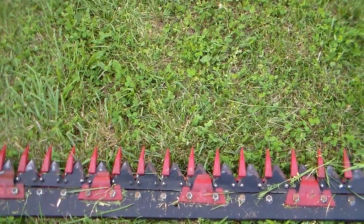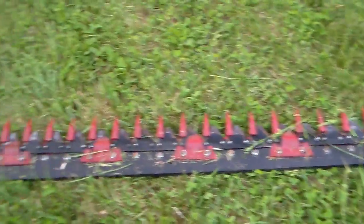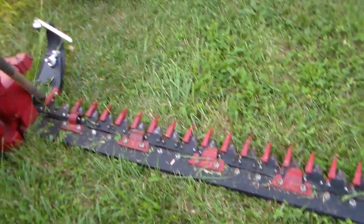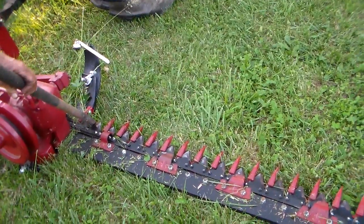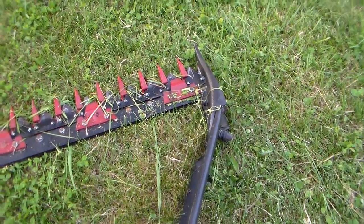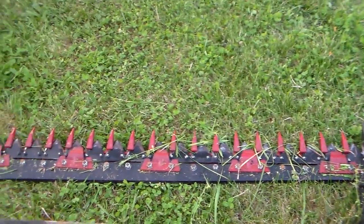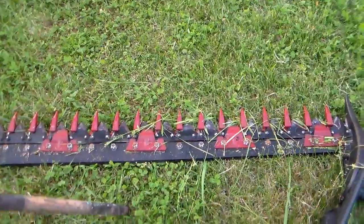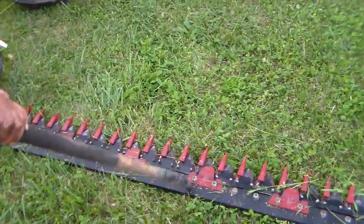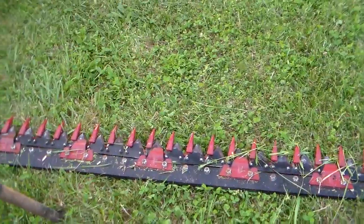All your guards are double and they're very new. They always send these out with the ledger plates that start your mowing process — there's one here on this shoe and one up here on this shoe. If those things are worn out, you'll have nothing but a headache. These are new. All the guards, everywhere it's needed, are put on with lock nuts — your shoes and like that — because if you put them on regular nuts, the vibration of the mower shakes them right off. But the lock nuts keep them in place.